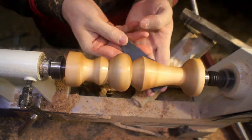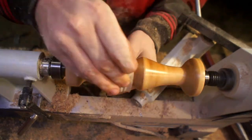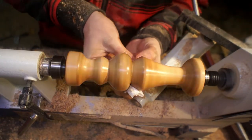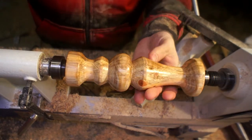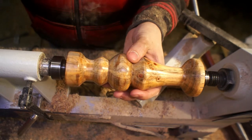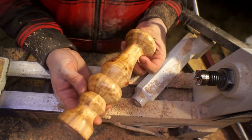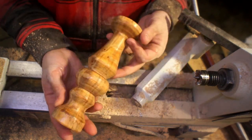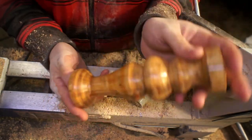What I'm using there is some orange oil and beeswax — basically to lubricate the sandpaper. I'm going up through 320 and I stop at 800 grit. This 800-grit on a cloth sanding back pad works really well; it really polishes it up nicely. With this particular one I didn't go any higher than 800. A lot of times I'll go to 1200, but I honestly don't notice a whole lot of difference. I think you can stop at 800 and be fine.